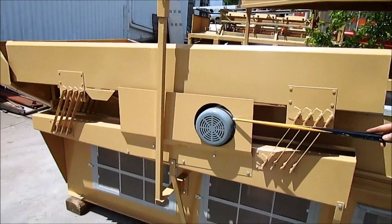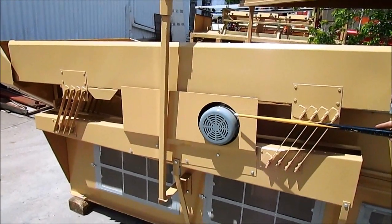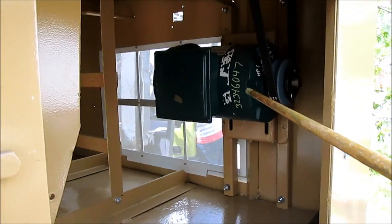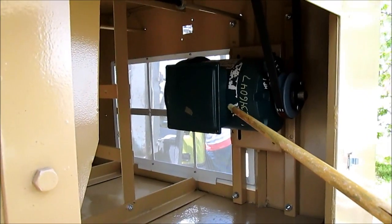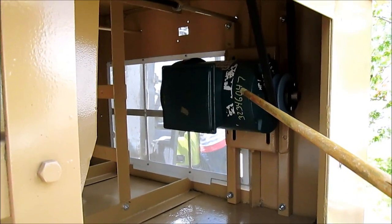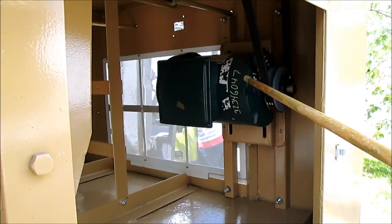It is also equipped with the motorized shaker conveyor. To control the shake of the deck, a motor has been added and a VFD controller will be supplied, so that you will have a keypad to control the RPM shaking speed of the deck.